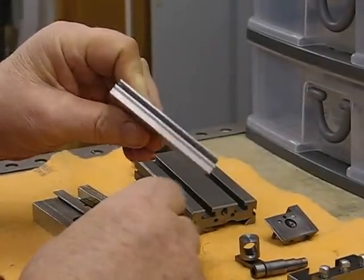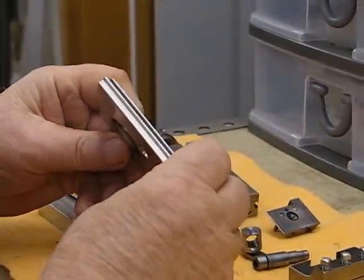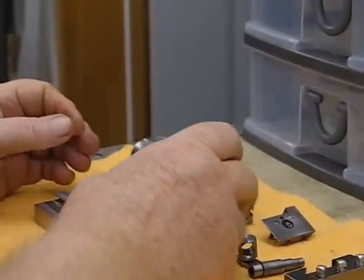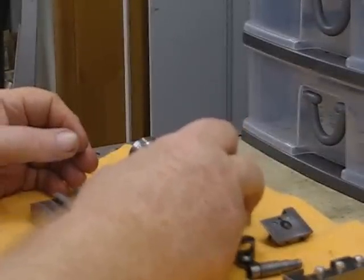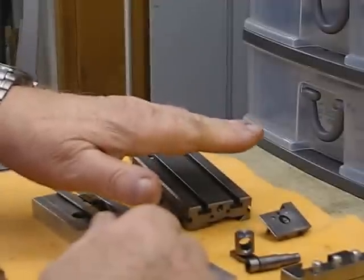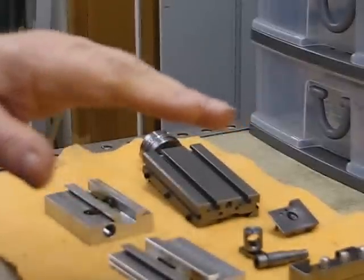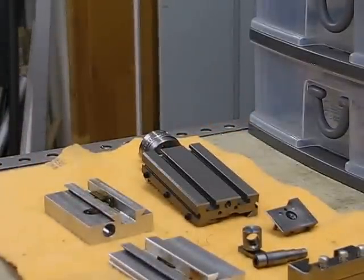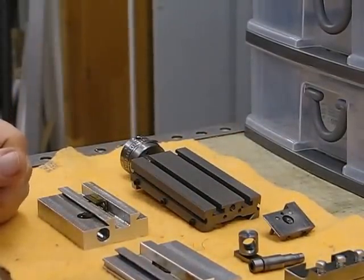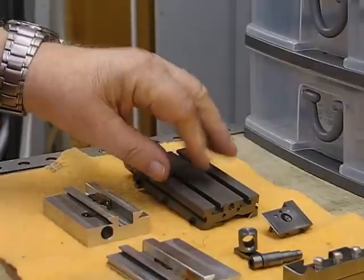The reason it's like that is it's an extrusion with a little bit of machining done on it — it's very thin. The reason for that is because when it's sitting on top of the cross slide, the top surface of the table is almost in line with the centerline of the headstock. So the only way you can machine with the original top slide is to clamp a tool bit on the top surface of the table of the slide.